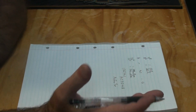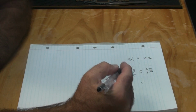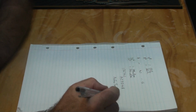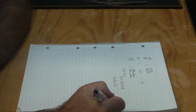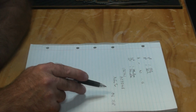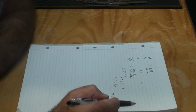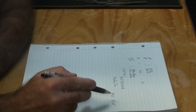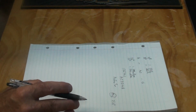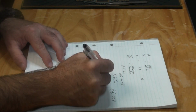So and here's another thing, the difference between the steps of the heights of the key pins is 0.6 of a millimeter, so that's about 23.6 thousandths, I think. And with Assa, you only need one step for a master wafer. So with most systems, the tolerance is a bit sloppy and you need 2 key pin steps. You can do the mastering on just one step with Assa. That's how good the tolerances are. But it even gets better than that. So let me draw you a key pin, folks.